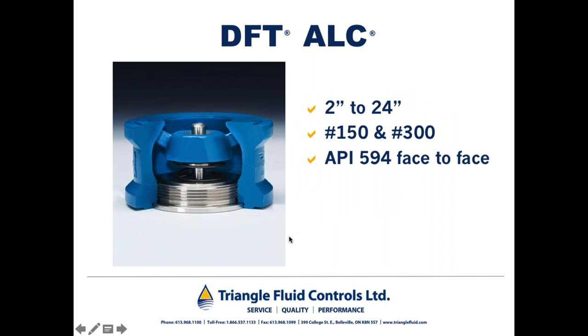Another wafer style model that we offer is the DFT ALC, available 2 through 24 inch throughout its entire range. Also, API 594 face-to-face dimension throughout its entire range. So again, we have a valve here that features a single guided disc only. Again, I would only recommend the use of this valve if we can achieve the 5 to 10 pipe diameters downstream from the discharge of the pump. As you can see here, available in class 150 and 300.